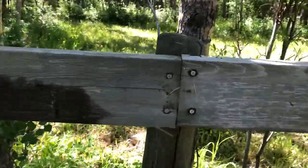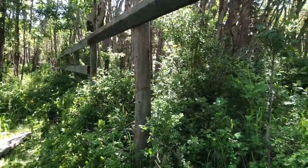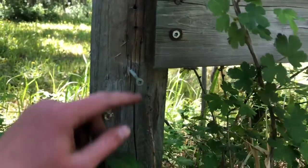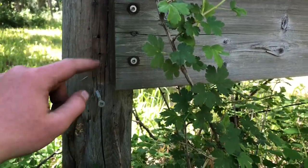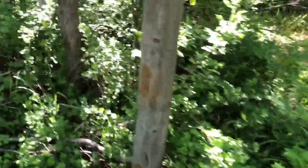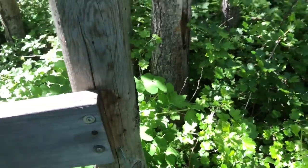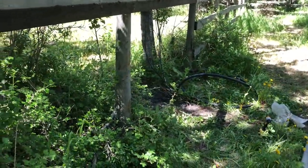I've got this top one all in place now — looking good. For doing a single-man job and trying to align three points, it's pretty hard, so I just take a 3.5-inch screw and set it a little bit below the board so I'm able to place the board on it. Then I can come in with the screw, lift it up, place it right where I want it, and pin it in. Once that's there the board is balanced. I do the same on the other side, and once the screws are in I can go along and fasten the rest.